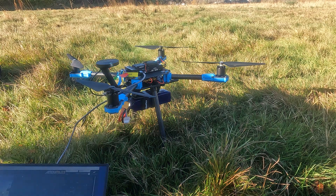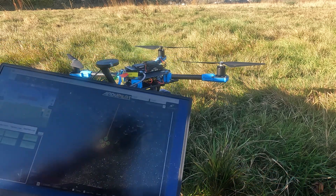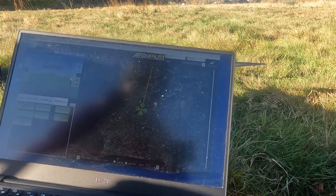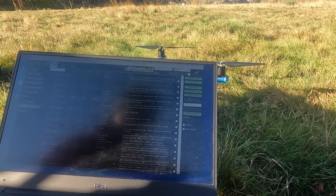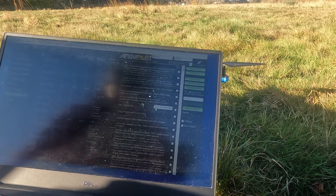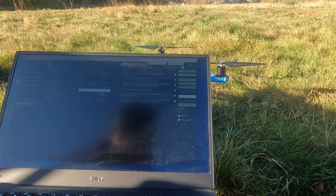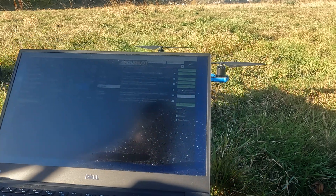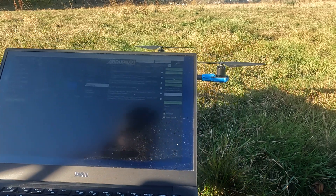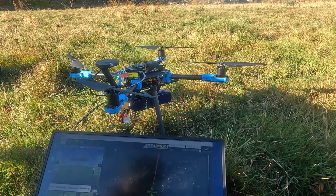I've got my mix set up now and I don't think I've done it quite correctly because the mode is slightly weird. What I'm going to do is just as a safety option — config RC9. So RC9 I want to be e-stop, emergency stop, which is mode 31. I'm going to put that on RC9.